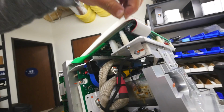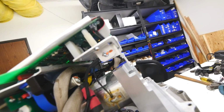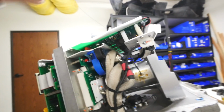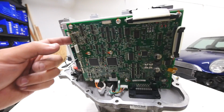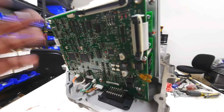There's some shielding here. These, I believe, there's 1, 2, 3, 4, 5, 6 of them. I believe those are the IGBT drivers. They're kind of encased in this epoxy. Then this is the signal that goes on top here, and this should be the logic board. This is the control part. This is the thing that we probably have to hack or replace and remove to put our own. Of course, we have a complete car, so we won't have to do that. We just have to connect it and see what part feeds that.